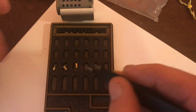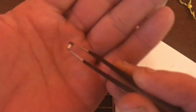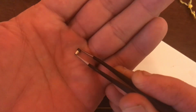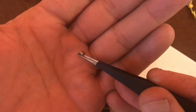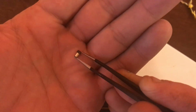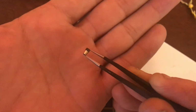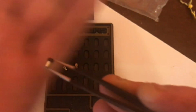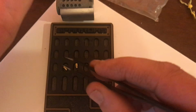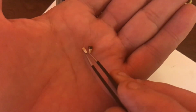So as I said, these were kind of hurriedly made. Now this one was very quickly made using only a jewelry file. And you can see it's not very deep. I ran the file more or less across it a little bit. And it really didn't take a whole lot out. So if you're just using a jewelry file, it's going to take a little bit more work than this. But the main thing I wanted you to notice on these, because I said when you make them, make sure you're running your file as flat and level as possible.